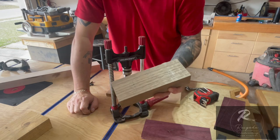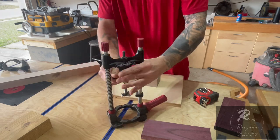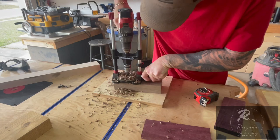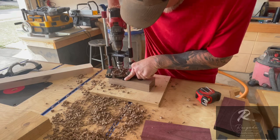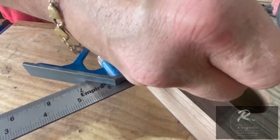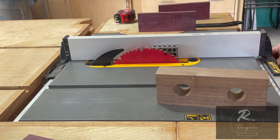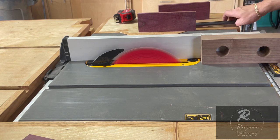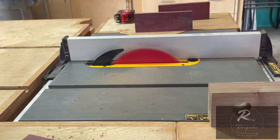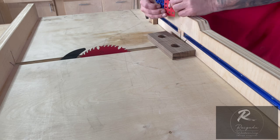I'll show you later why we're putting two holes and splitting this down the middle — it'll make sense at the end. We're going to get our inch-and-three-eighth Forstner bit in here; these bits are amazing. Attach a drill to the top, get it all lined up, and start punching some holes. I'm going to find the center, use this to get a little two-degree angle for the wedge insert, mark it up. The center core is too thick — I just wanted about an inch. Wish I thought of this sooner; would have saved time on the drilling. We'll go ahead and rip these down in half.